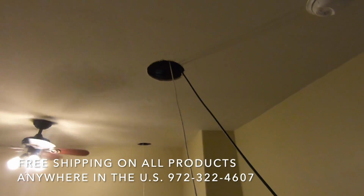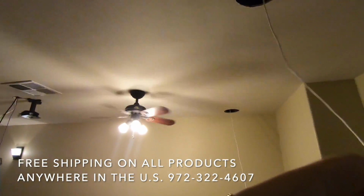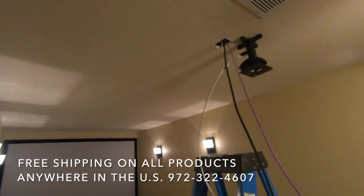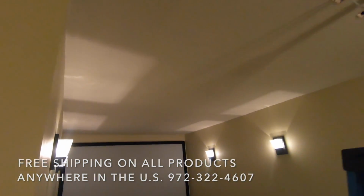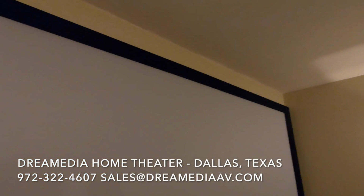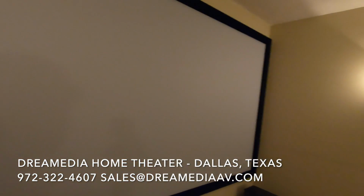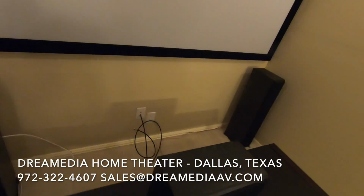Alright guys, as you can see here, I got the subwoofer cable, coax, and surround left speaker line ran, fish rod, surround right ran, as well as over here I have HDMI, Cat 5, and Romex for power. And I already got it fished over. I ran up in the attic a minute ago. I got it fished over here and down the wall, and behind this wall here is the garage. So I'm gonna go in the garage attic and grab my fish rods from up there, and I'm gonna cut a hole in here and then shoot them through. All right, I'll keep you updated.